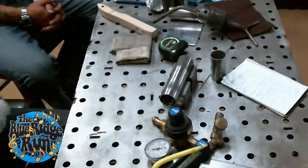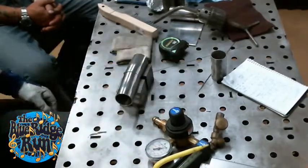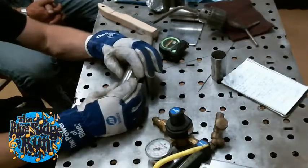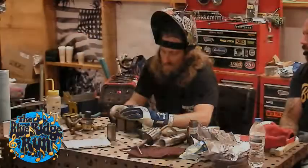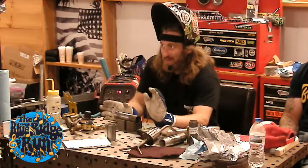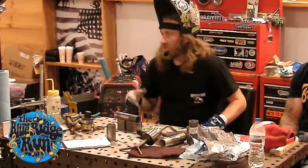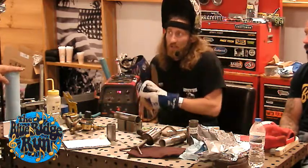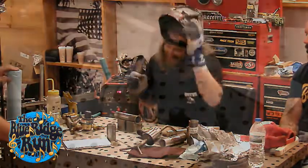So if you, like I was saying, double the amperage, they call it a laser tack. You'll set the tungsten in the seam, roll it back slightly out of the seam, but you kind of want it straight up and down so that the arc is directed at the material. It's just a quick one to two seconds maybe in that spot, but it's a full hammer on the pedal, and you'll see it just happens really quick. Or it'll blow out. So there's a fine line here.